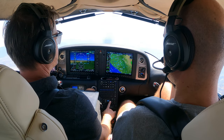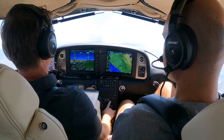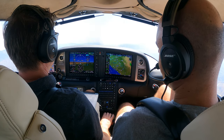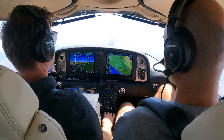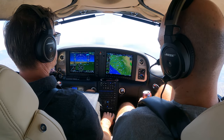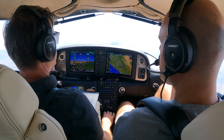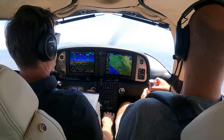Your temperature looks good. My number is 220. That's my personal number on the oil thing. Yep, there you go. Get up there, get it over with. That's it. You see how your CHT is the wrong thing to look at. This thing will climb, will reach red line, you'll get a CAS message while your CHTs are 402. This is a more accurate, live, immediate indication.